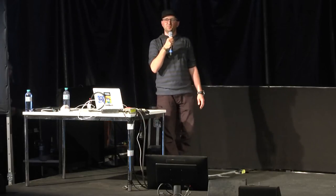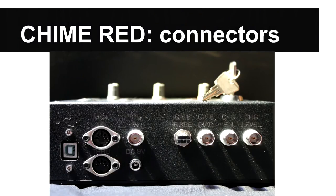And here are the connectors on the back. Apart from a fiber optic connection that goes to a dual resonance style coil, there are another couple of connectors over to the right, which are interesting. These are for controlling the 20 kilowatt, 1 kV DC power supply. How we test that is we use MIDI to play a commercial oven element. You could hit a couple of keys and bam, just drop a whole lot of power into this element. That's how we made sure, before we actually played it live on the coil, that we weren't going to blow anything up, except for an oven. Controlling large amounts of power by just playing a musical keyboard seems very wrong, but that's what those connectors allow you to do.